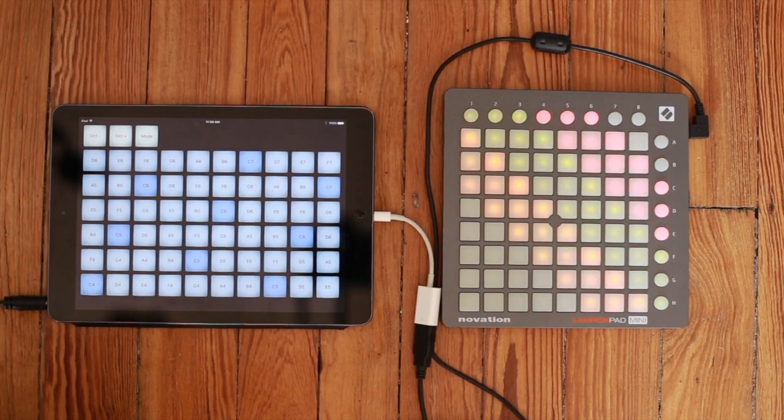Now, it's important to remember that if you're using a Launchpad Mini, you must set it to low power mode. If you look in the manual, it'll explain how to do that. Otherwise bus power won't power it. Your other option is you can use a powered USB hub, which allows you to use the Launchpad Mini in full power mode or any other Launchpad.